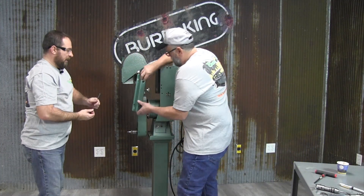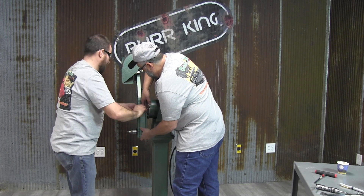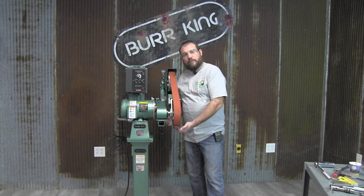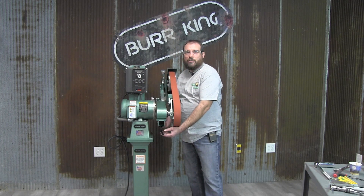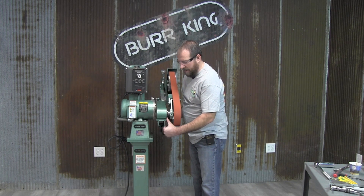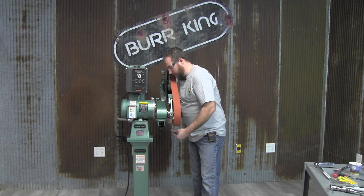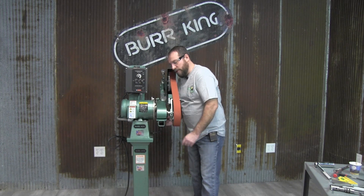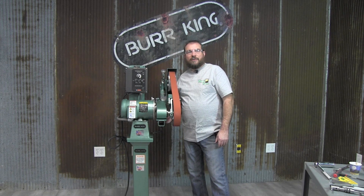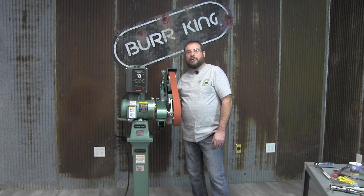The hardware that you need to attach this bracket comes supplied with it. So we've successfully installed our articulating arm receiver bracket. When you install this receiver bracket, you want to make sure that the side of the bracket is flush with the contact wheel side of the frame. You can look down through here and there are a couple of bosses that it lines up with nice and smooth. Any machine produced after 2017 will have the three holes already drilled into the backside of the frame, so you would not have to worry about doing it on newer model machines.